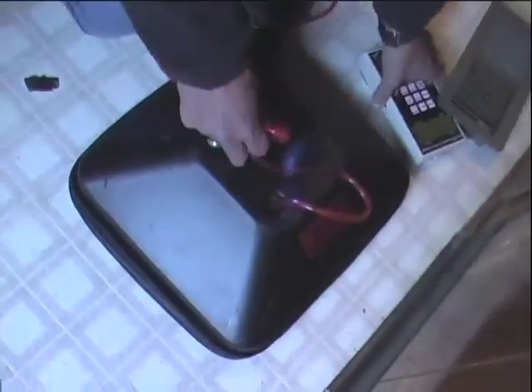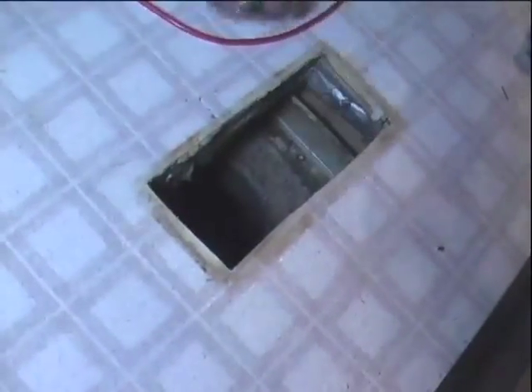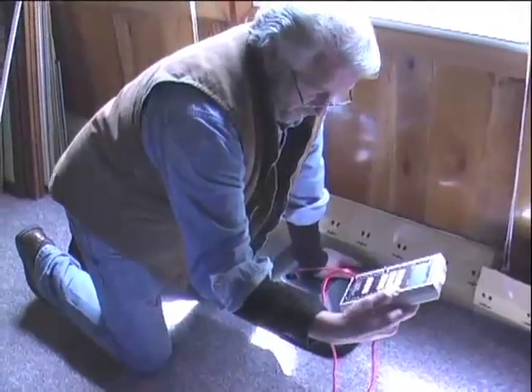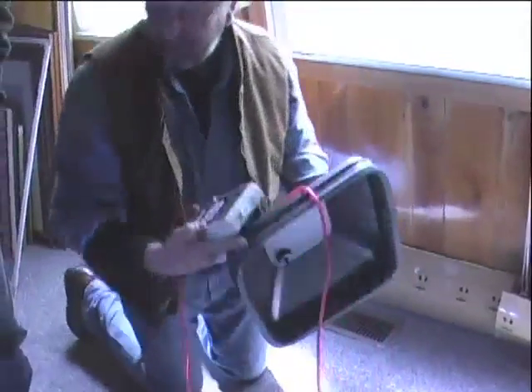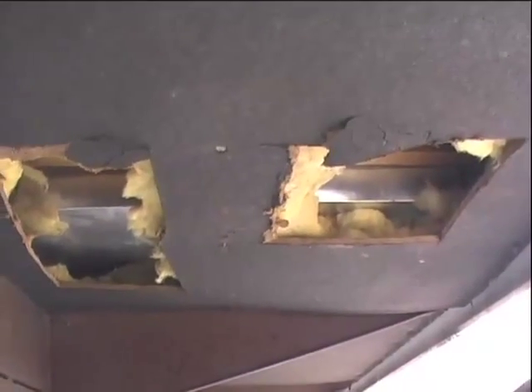What I really liked was seeing the duct pressure diagnostics with the duct pan. It's beneficial, and it'd be easy enough to make your own duct pan and start doing your own tests. Before, you'd just do a blower test and feel air coming through the ducts and do mandatory duct sealing at the boots. But by doing duct pan testing, you can seal the boots and it still tells you whether you still have a problem internally, where you'll have to get into the belly and investigate.